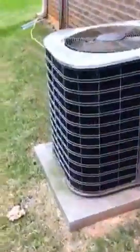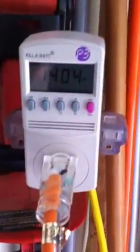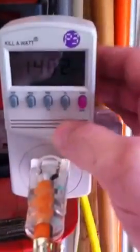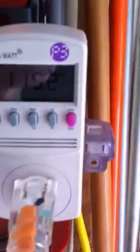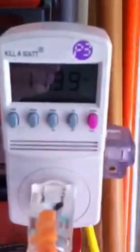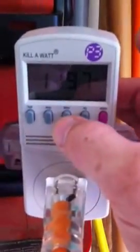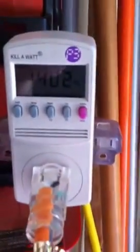I know some of you are saying you're going to lose voltage — I'll show you that in just a minute. One thing I liked about this generator is that it provides a very stable and clean source of power, so you can charge laptops, cell phones, and things like that. The yellow cord is plugged into a kilowatt meter showing about 1,400 watts. It's doing 119.2 volts right now and I'm drawing about 12 amps. The generator's capability is about 13.6 amps, so I'm still underneath that.